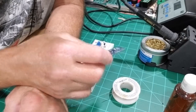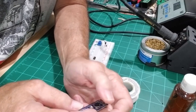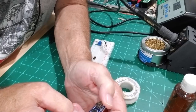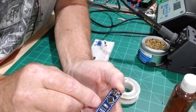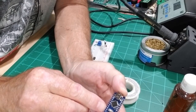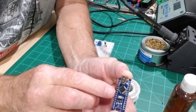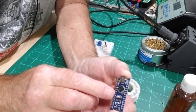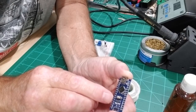This one goes all the way up to A7. The Uno only goes up to A5, so there are a couple of extra analog inputs. I think the last two — A6 and A7 — you can't address as a digital input or output; six and seven are specifically analog pins.